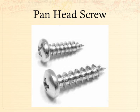A pan head screw, also commonly called a sheet metal screw, is another type of screw for fastening material together, usually used for fastening metal to metal — like thin pieces of sheet metal. The pan head refers specifically to the head type. Instead of being a bugle shape to go into a countersink, they're more of a mushroom or dome head, so it sits on top of the surface of the material and won't pull into it — which helps hold them together better.